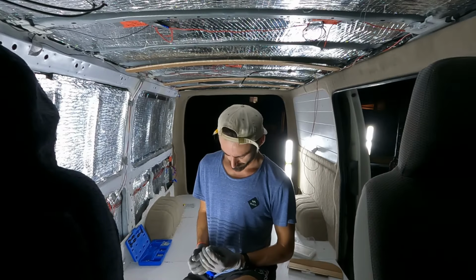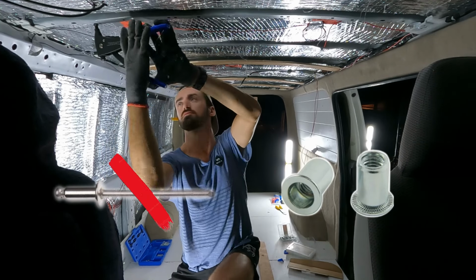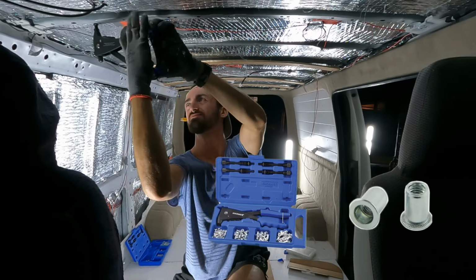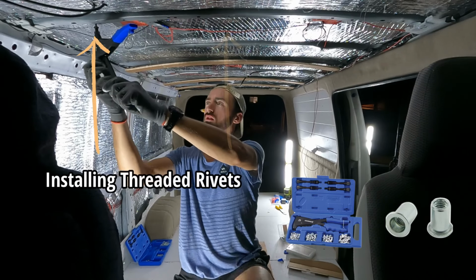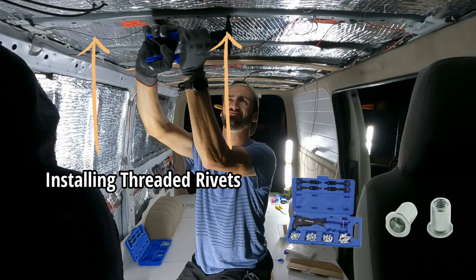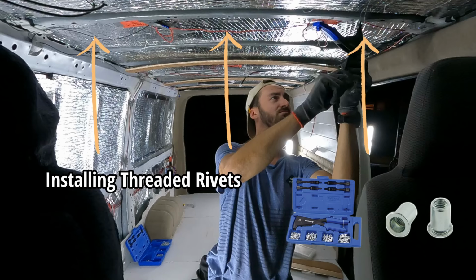The second option for mechanically fixing your strips to the wall is using bolts. The way that you do this is by using a riv nut or a nut riveter. This is not to be confused with a standard rivet gun, but is essentially the same principle where you drill a hole and then rivet this riv nut in place. Once you remove the riveter, the riv nut is in place and it has a solid 6mm of thread for a bolt to hold onto.